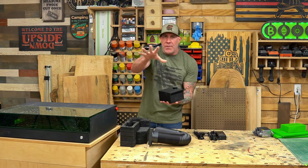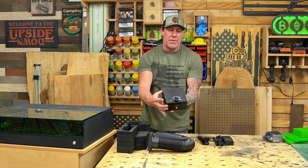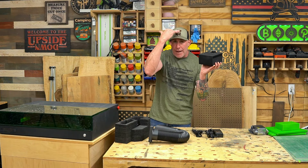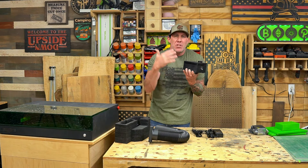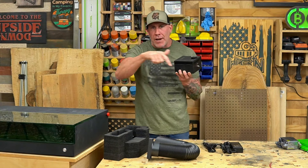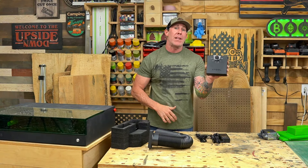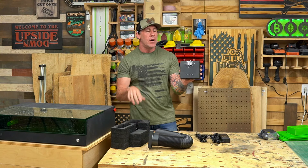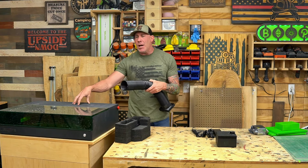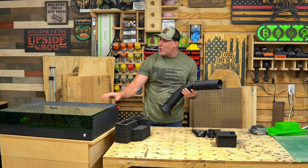One of the most important features on a laser engraver is air assist. The basic kit includes this little box and a quarter-inch airline. When doing things like leather hat patches you don't want soot building up — turn the air assist down for engraving and turn it up for the final pass cut-through. On this unit the air assist works automatically, which is really cool. It also comes with an onboard pump to extract fumes out a window.